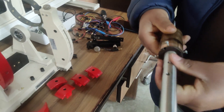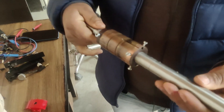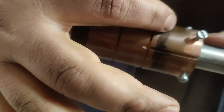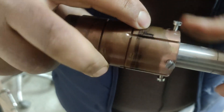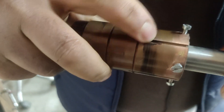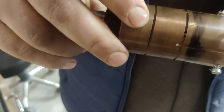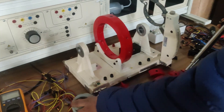You can see we have the shaft, and on the shaft we will design the lap wound armature of the DC shunt generator. The various components used in designing the armature include, first of all, the commutator segments. You can see these commutator segments have screws attached — there are one, two, three, four commutator segments. To the left we have continuous copper strips: these are the slip rings, and those are the commutator segments. Since we are designing a DC generator, we will use commutator segments.